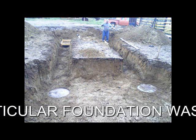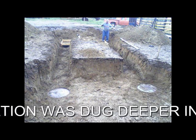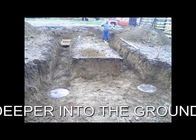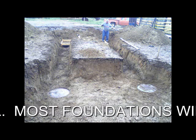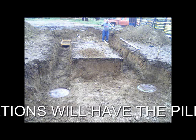Cut out the top and place them upside down in the hole. Once they are in place, squared, and you have backfill around them, simply cut out the top using a torch. The bottom of the barrels must sit 48 inches below the surface to comply with foundation regulations.